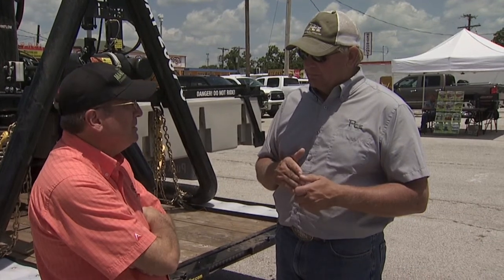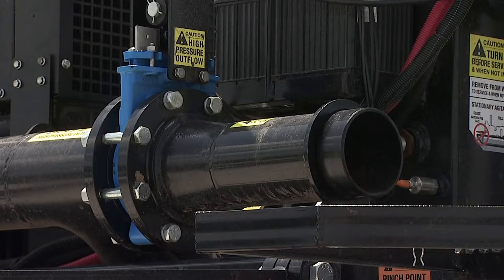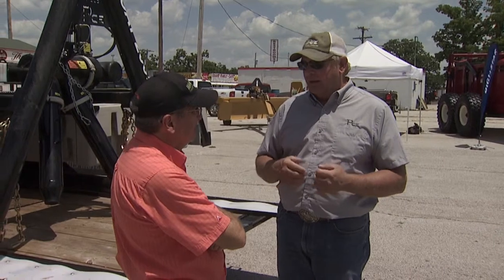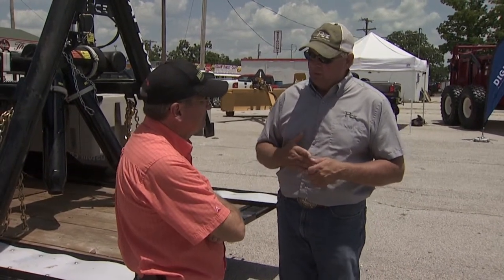The boat can move about 4,500 gallons per minute at short distances up to about 120 feet at 35 to 40 pounds of pressure. It can also be hooked to a drag hose or main line — three pieces of eight-inch hose run three-eighths of a mile to a jump pump, delivering 2,500 gallons per minute off the same platform. Running continuously with eight-inch hose up to a mile pulling two five-inch drag hoses, friction loss equals the pump curve and yields about 1,450 gallons per minute to the field.